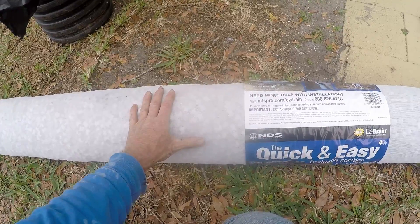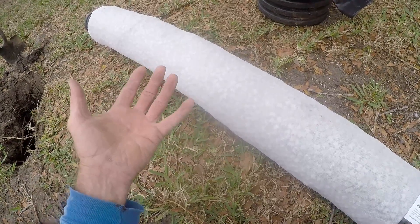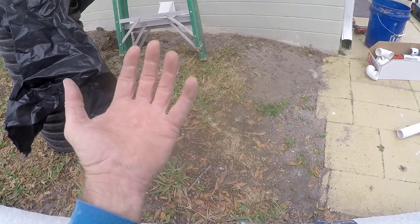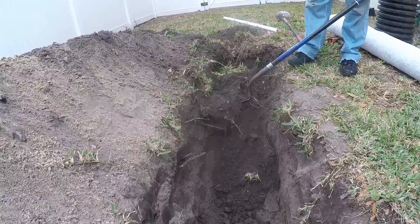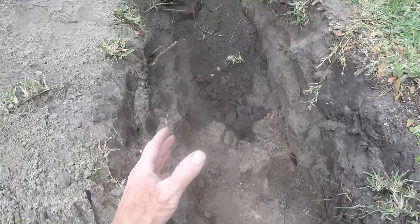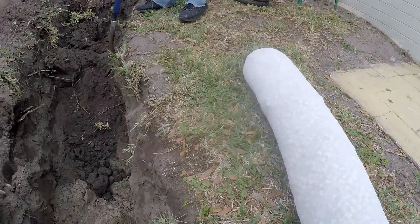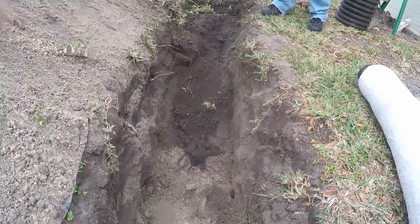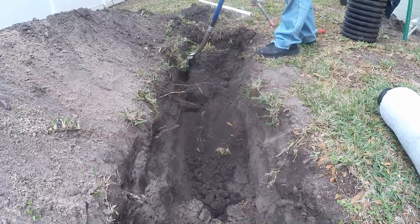Remember, the problem was the smell. When your drain field or leach bed goes bad, the odor is going to start coming up through the ground. This water has actually moved under the slab of the home, and it's penetrating through that concrete — eventually you get that sulfur smell, that soap smell. Over here, we're getting ready to open up the trench from the chamber, and I'm about waist deep. We're going to put in the Easy Flow drain — two of them — so we've got double the capacity. Once we open it up, that water is going to flood right out here, so it'll be a real mess for a minute, but we'll cover it all up.